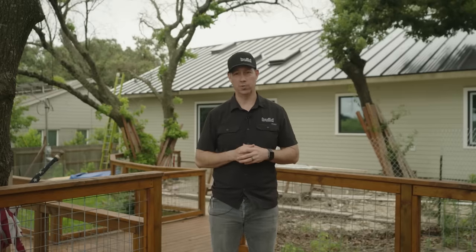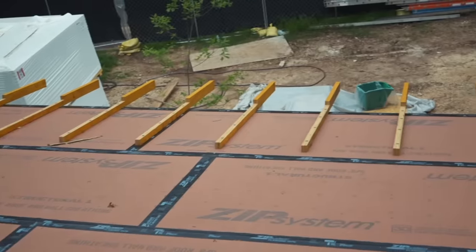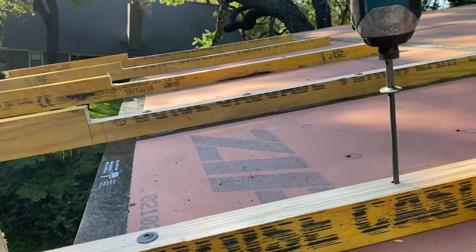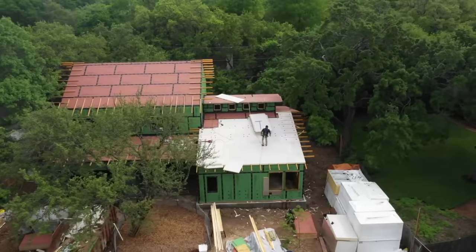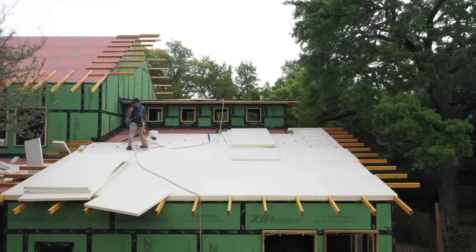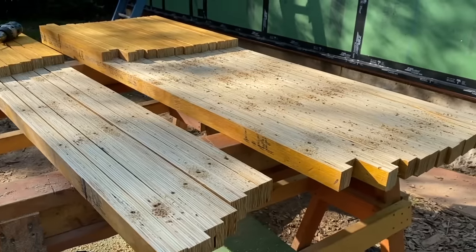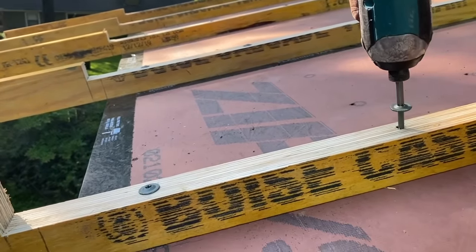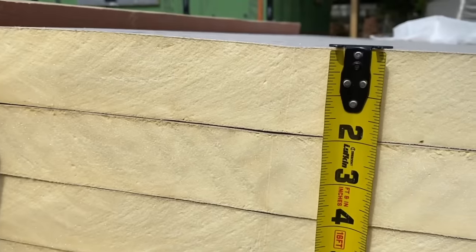After that, I'm putting my poly iso on the roof, but you'll notice that the poly iso is put down after I've installed some fake rafter tails. These rafter tails allow me to get a good-looking overhang, but they're not into the framing — they're on top of the framing. We used some two-by-six LVLs, cut into an L-shape, screwed down with some SPAX power lags into the rafters below. On the outside they're the full four-inch depth, but where they hit the roof deck, we've thinned them down to two inches.